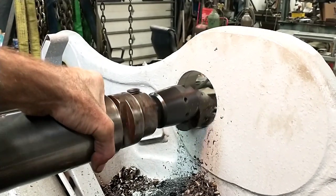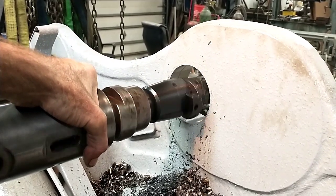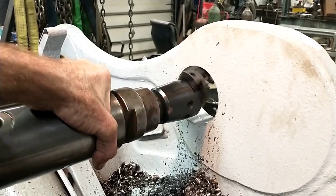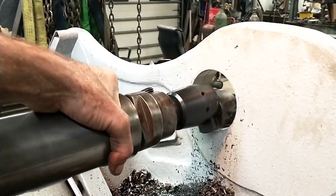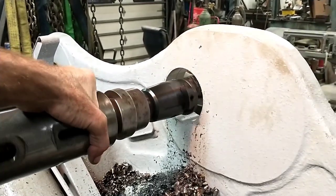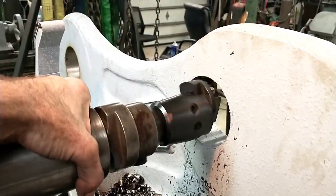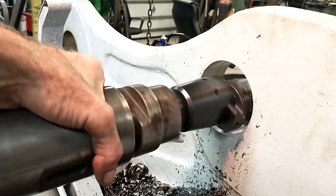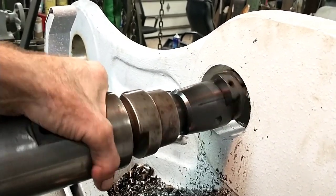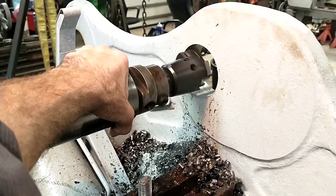I've been wanting to try something, I just haven't had time. I want to machine a harmonics balancer off from a diesel engine to fit on the spindle of this. I want to machine some to fit my boring bars, because I think one of those riding along would really go a long ways towards stopping this nonsense. I seen some guy in a video, I forget, India or something. He had a great big flywheel riding along on his, and that seemed to do the trick. But I would think a harmonic balancer would really be the ticket, though.